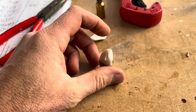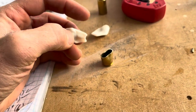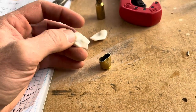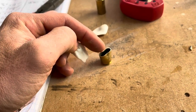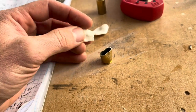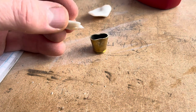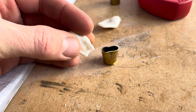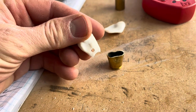That should set right in there like that. I think what I'm going to do now is drill a hole through the ivory at the base so that when it dips into the solder, the solder will be locked in by the tapered shape there, and it'll also fill the hole in the ivory and that'll hold it in place. I got my hole. If you do this, be sure to drill really slowly — I chipped it there with the drill bit and had to back off and lighten up on the pressure. You could easily just break right through it.